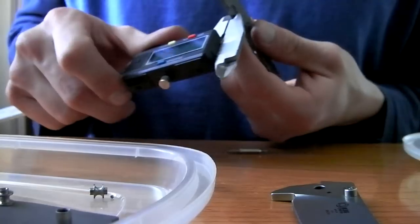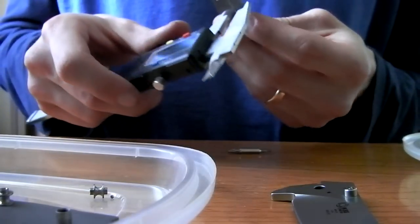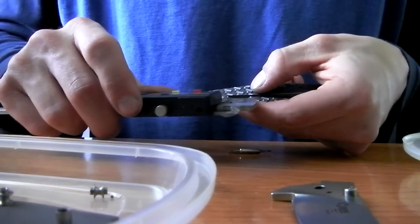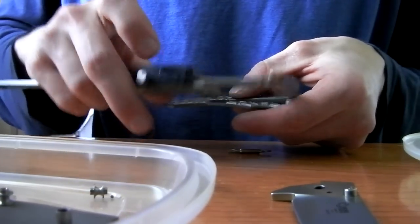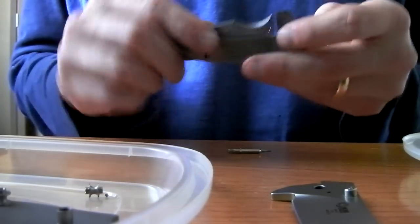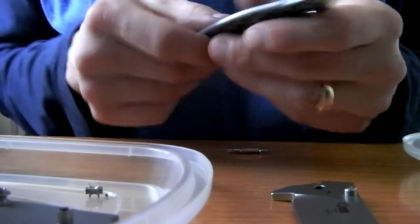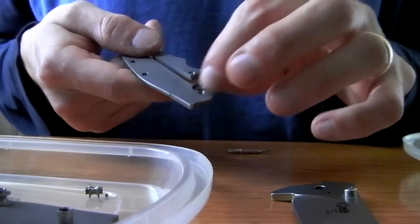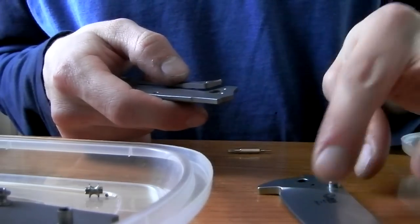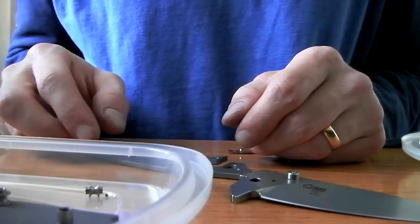This might help other knife makers. The thickness of his lock bar cutout is 43 thou, 42 thou. Width of it is 300. Length of the cutout area is about 3/8. Length of the bar is about, I don't know, 2 1/4. So yeah, like I said, he hides the bearings completely inside the titanium handle, which I've heard is very common with AKBS. And the blade is just totally flat. So, nothing else really to say.